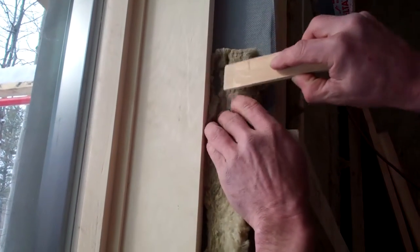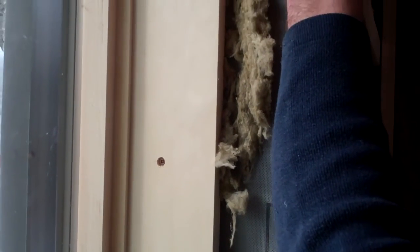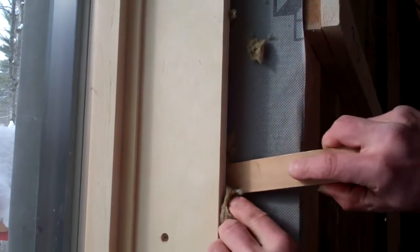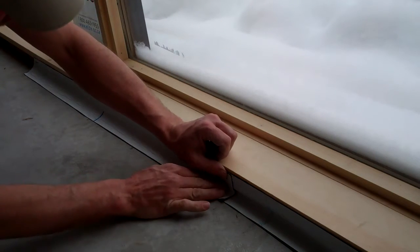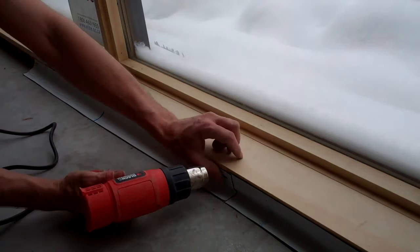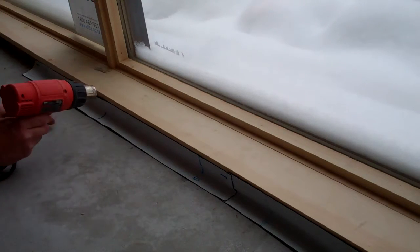Next, you insulate between the frame and the rough opening. There's more than one way to do this. If you're using spray foam, be sure to use a low-expanding foam so it won't deform the frames — it'll usually say 'window and door' or 'low expansion' on it. Fiberglass insulation works fine, but if you compress it, it actually loses its R-value, so you have to be more careful with it. Here we're using Roxul since we have it on hand. Any of these three materials, foam included, will act as insulation but not necessarily an air barrier. Spray foam is often counted on to stop air leakage, and it will at first, but houses shift and move. In our experience, there's no play to foam, so I've seen a lot of cases where there is air leakage — so not my favorite technique. If you are using foam, it's still a good idea to tape or caulk afterwards to make sure you're airtight.